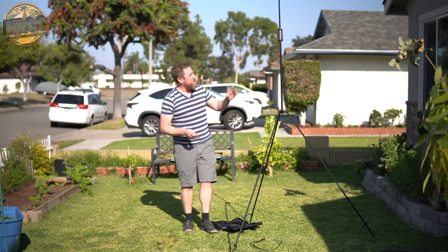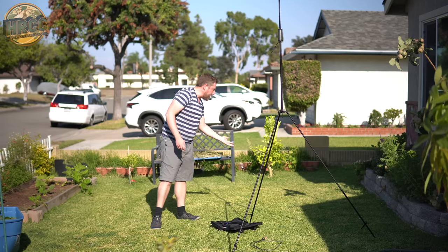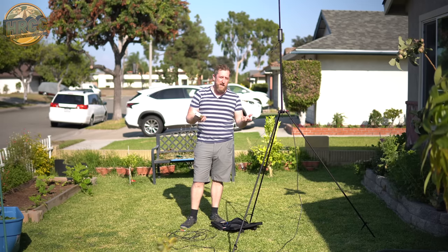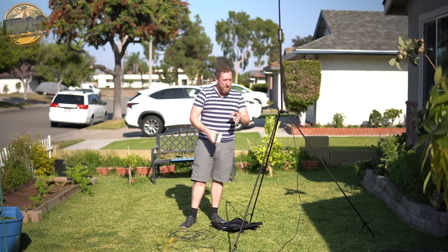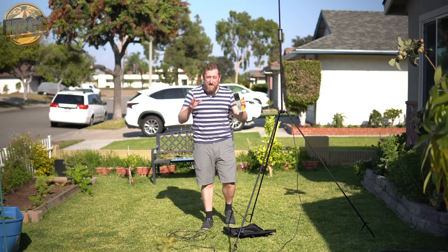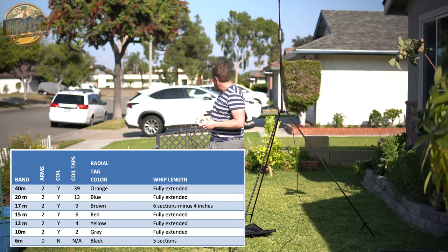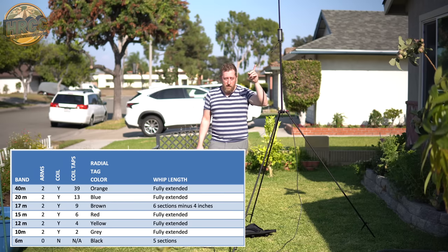The next step is to do a little gross tuning. By gross tuning, we're going to adjust where we tap the coil and adjust the length of the radial, and we're going to check it with an antenna analyzer. I've dragged out my antenna analyzer — this is an inexpensive AV7100 that I got a couple of years ago. You could use a nano VNA for this, or simply use your radio's SWR meter — I have a video on that process, link in the description. The instructions for the BuddyStick have a nice table that talks about the vertical whip length, the sections extended, and the color for the heat shrink on the radial, as well as where to tap and how many coils to count.